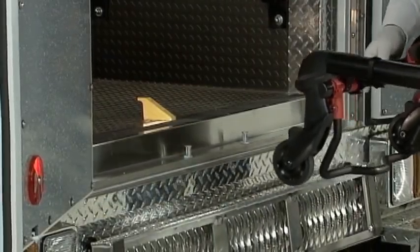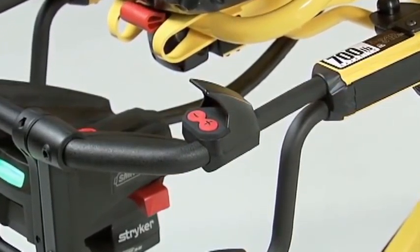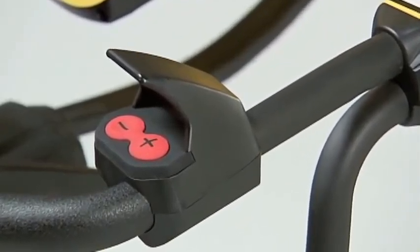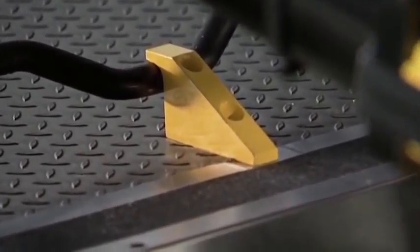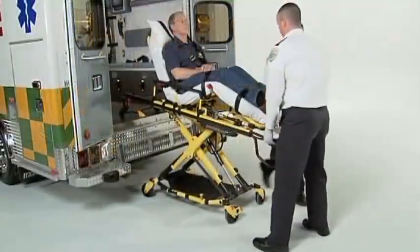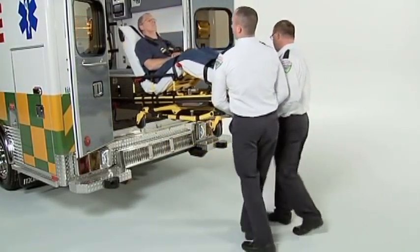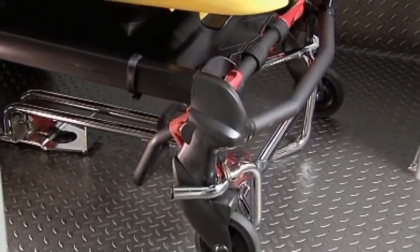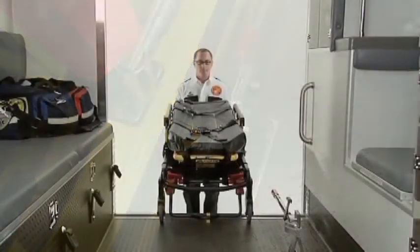If the loading wheels do not clear the vehicle deck, activate the jog function: remove your finger from the plus button and press it a second time, holding it down for one full second — the cot will jog to its maximum height of just over 35 inches. After the loading wheels have moved onto the vehicle deck and the safety hook has engaged the safety bar, both operators assist in lifting and loading the cot. Position yourself to accept the weight of the cot and patient. Press and hold the minus button until the undercarriage retracts fully — this takes less than three seconds. Finally, roll the cot onto the deck, guide the cot into the antler, push the cot to the side and into the cot fastener, and make sure it clicks around the cot retaining post. When loading or unloading an unoccupied cot, the process is exactly the same except it can be done with a single operator.